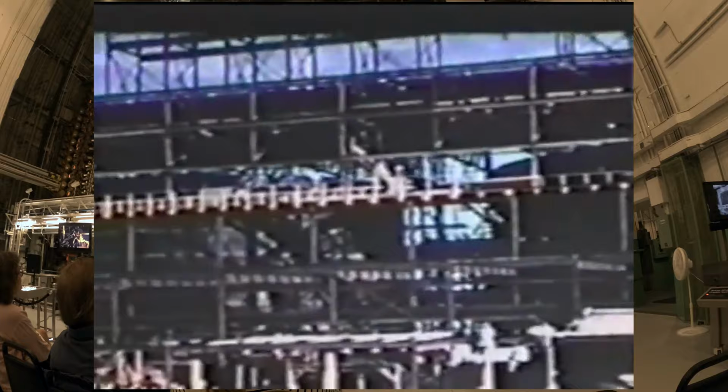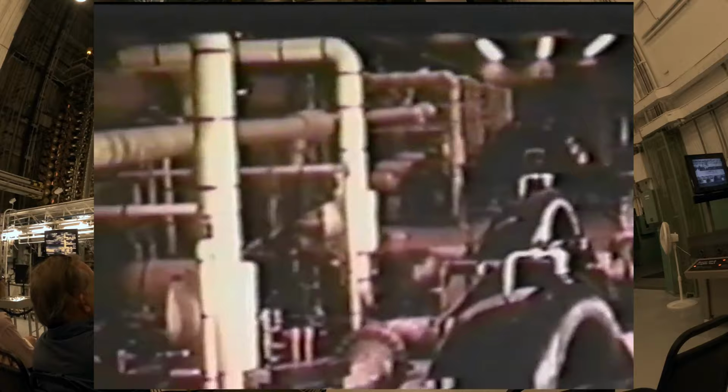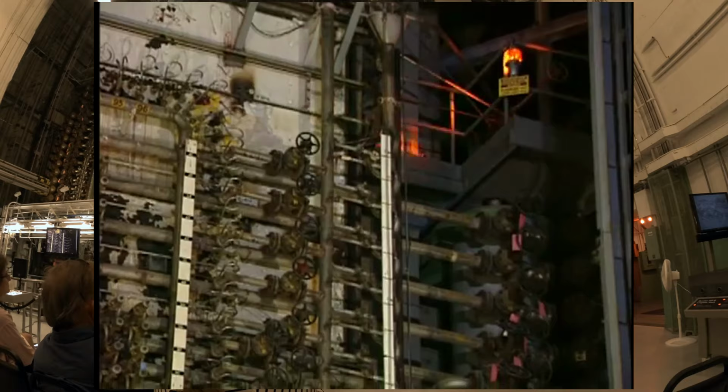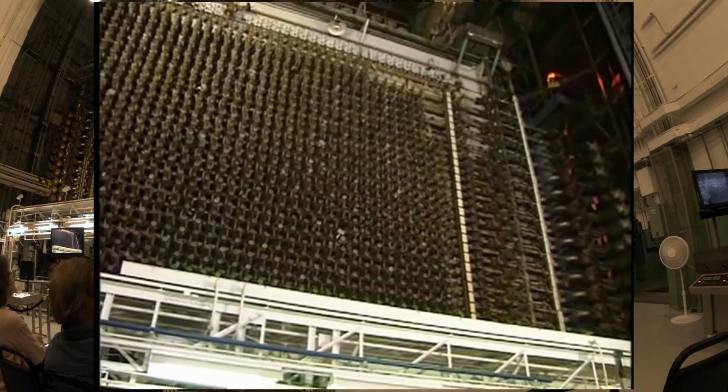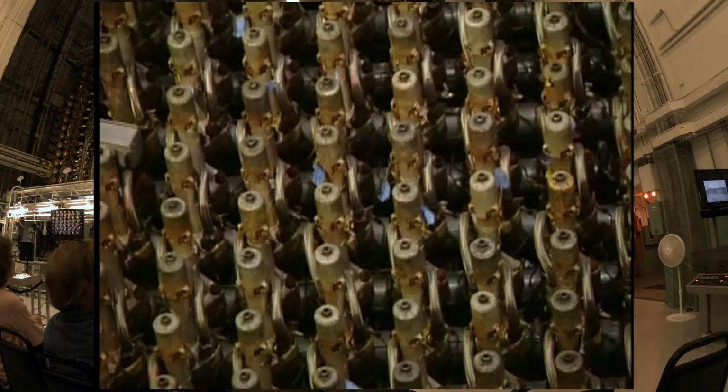That water then comes out of the 190, feeds up to the headers, through the cross headers, which are 42 of them, through the pigtail nozzles, and into each process tube. Basically, the flow splits the 27,000 gallons per minute, and each provides to the core area, which is their hottest area, a higher flow than in the perimeters around the outside because they don't produce much heat. The water that flows through there takes about a second from the time it enters the process tube until it's discharged out the back. With precise construction and imaginative design, the reactor core you see before you was truly a marvel of engineering.